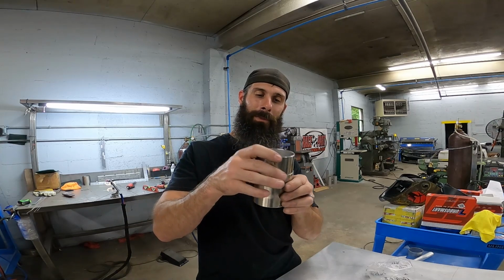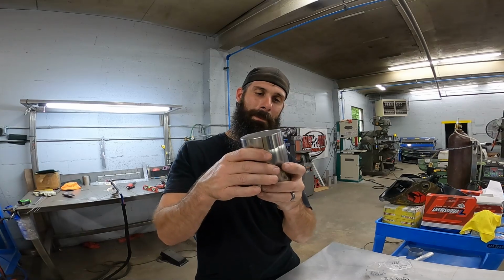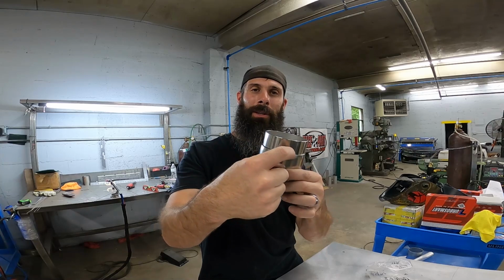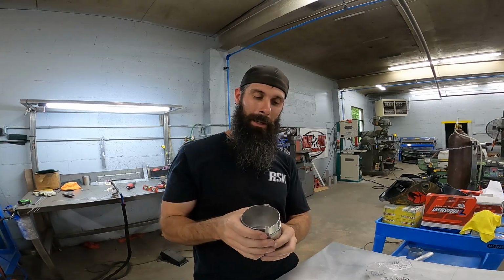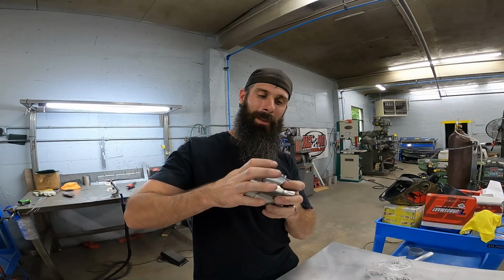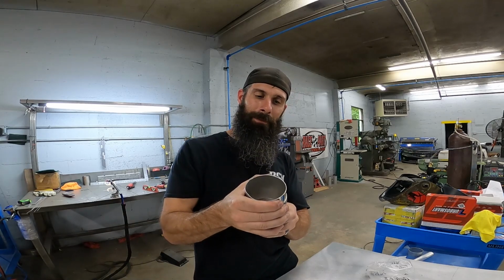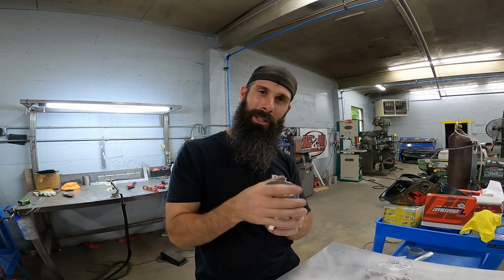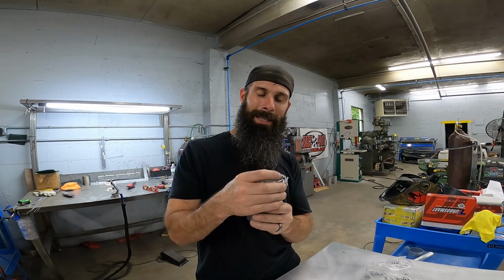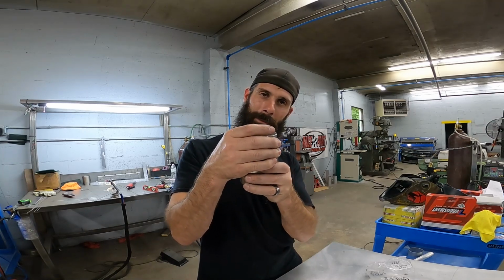So put them together, collar drops on, you weld here, here, and around the pinch part. What I do when I do mock-up, I don't put them super tight together. I usually will cut my stainless pipe just a little bit short, where maybe it's 1/8 of an inch or less of wiggle room, like that.